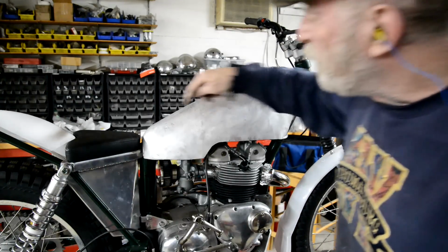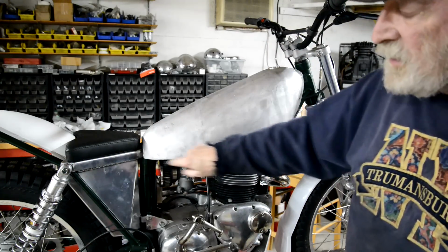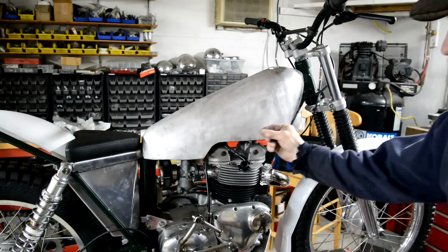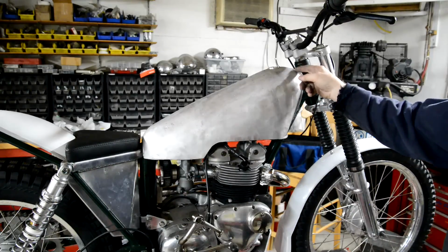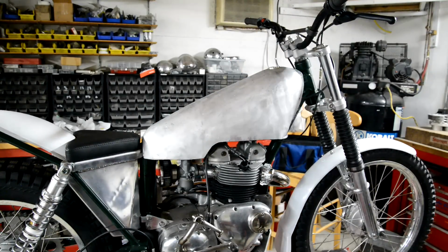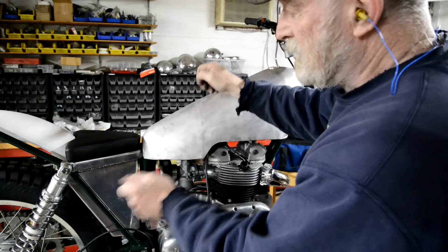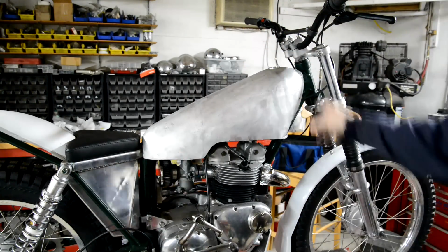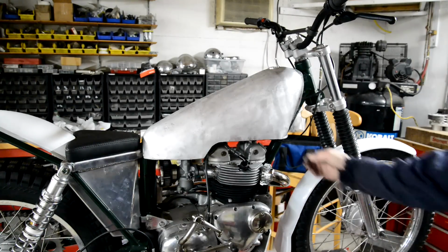The reason I want the big rods is for this end and this end. The rest of it I'll actually probably just weld up with 16th because there'll be close edges, but there's a couple of little gaps around there and around there that I don't want to try and fill with 16th because I'll be too long on the spot instead of being able to put it. In fact, I might even get some 8th rather than 3/32. We'll see what they've got when I go down tomorrow.